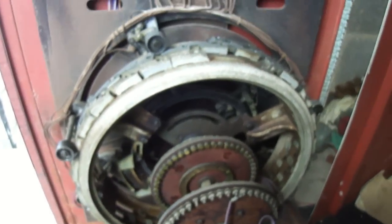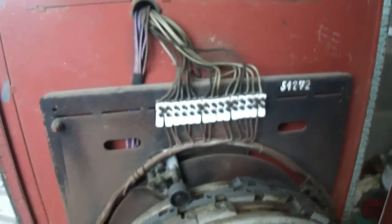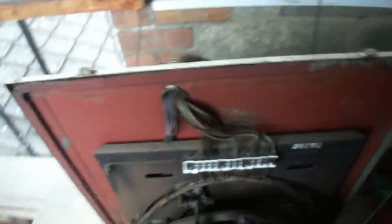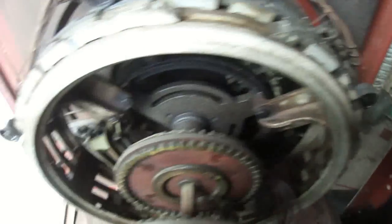This is the floor selector. If only I could get this to go to a floor — that would be cool. This is an old Schindler floor selector. All the connections are here. What happens is, when the lift moves, it activates all these cables and it turns this big drum. And this tells the relays inside there where the lift is.